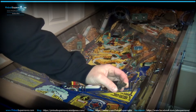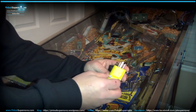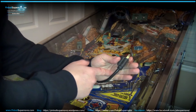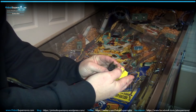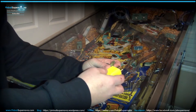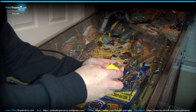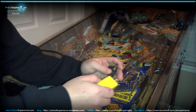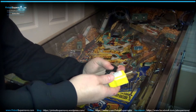What we're going to do is replace this outlet end with a new one. You unscrew the two screws, the cover comes off, and then you attach the wires after we cut off the old plug end. This replacement has a third prong which is the ground. The right side of an outlet is the power or hot side, the left is neutral, and the bottom prong is the ground — we need to match up the wires accordingly.